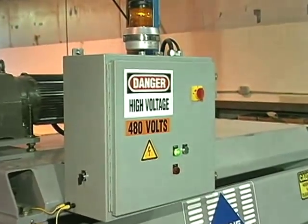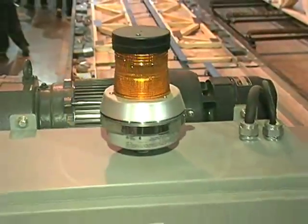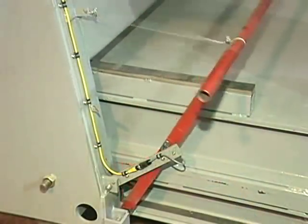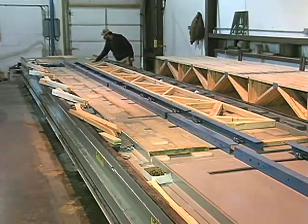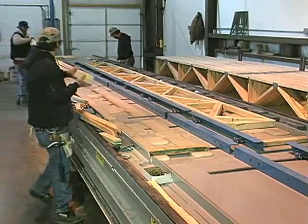Other safety features include an emergency stop switch on the gantry control panel, a yellow light that flashes and a horn that sounds when the gantry is moving, and front and back gantry shutoff bars. In addition, the flip over arms will be instantly stopped in mid cycle if the actuator button on the pendant is released when the operator sees an obstruction.